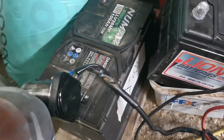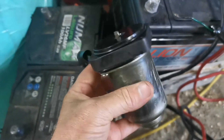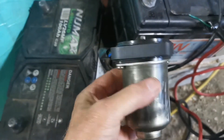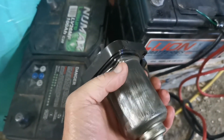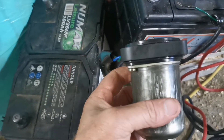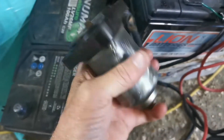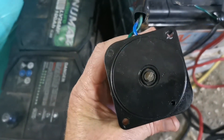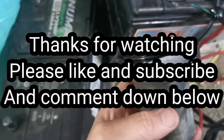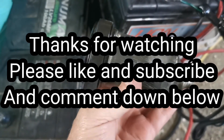So that worked — saved me £200. I hope that gives you a bit of insight into how these motors work and common problems. Maybe before you splash out the money, if you don't mind having a go yourself, the epoxy is probably about £12 and it's about an hour's worth of work plus letting it go off overnight. It's not hot or anything and it's working perfect. Don't be afraid to take something apart and have a look — on this one it was a cheap fix. Thanks a lot, see you next time.